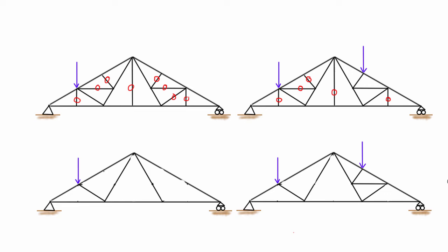Now things get more complicated. Here we have four members at this joint, so we can't make quick observations. At the next joint we also have four members, and we can't rule anything out there either. And here we have a joint with a point load acting directly on it, so we can't simply say there are two co-linear members and a third that must be zero force.